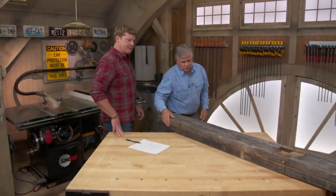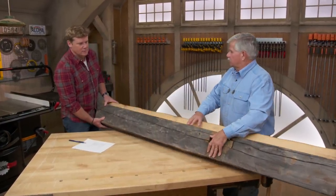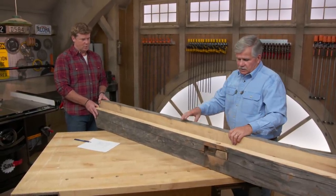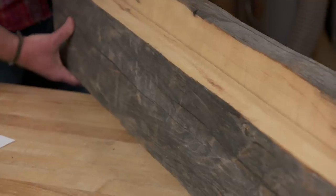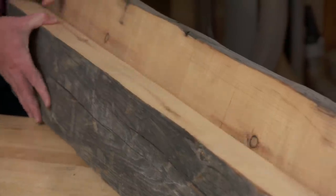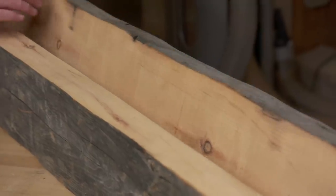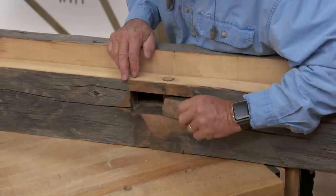So what's the story behind this? Well, this is one of the beams out of many that we save when we rip down or demo projects. I like to save old wood because I just like the tightness of the grain. So when you say beam, would this have been sort of a big 8-inch thick, 10-inch high? This was an 8x10 beam, and it might have been used for a diagonal brace or a collar tie of some type. It's aged on the outside, but when you sliced into it down to the nice wood — and what species is this? This is white pine. You can still see remnants of the old mortise and tenon, even a peg. Yeah, the peg's there, and a piece of the tenon that went in there is still there.